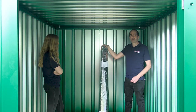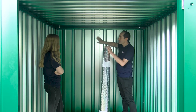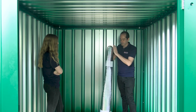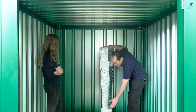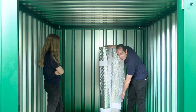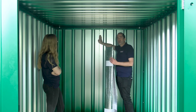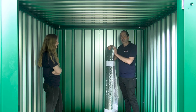When fitting your insulation kit, you want to start with one of the wall pieces first. This is going to run from the middle of the back of your container, across the back, and down the sides — it's even going to cover most of the inside of your door. Looking at your kit you can see it's not quite big enough at the moment — you've got industrial sticky back plastic strips on the back, and there's also a fold with some more sticky back plastic, so we're just going to unfold it. I'm going to ask our helper to hold this into position whilst I push it along all the panels down the side of the container.